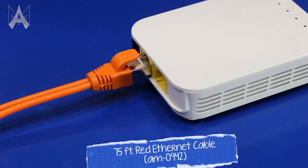Make sure when you get to your event you visit the FRC radio programming station in the pits as soon as possible, so you're ready for your first matches or field connection tests. Don't swap your radio after you've programmed it at the radio configuration kiosk — if you do, you won't be able to connect to the field with the new radio unless you reprogram it. Also make sure not to program your radio yourself with your own computer, as it does not have the required encryption key to connect to the field. Once your radio is programmed, bring a long ethernet cable or USB cable to connect to your robot's RoboRIO or radio in the pits, since wireless connection won't be available.